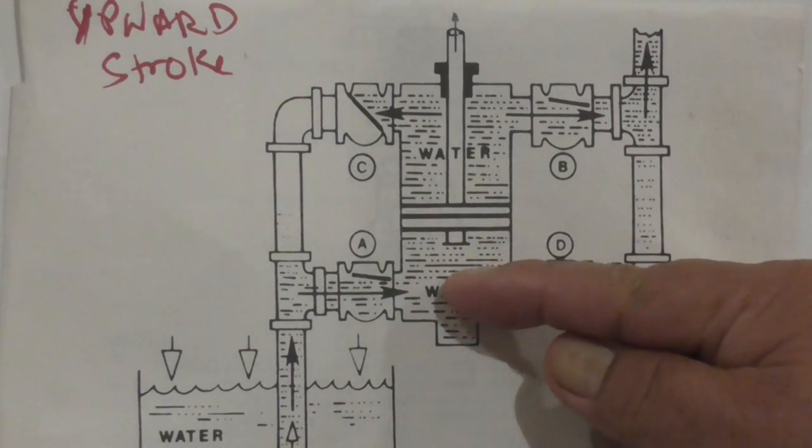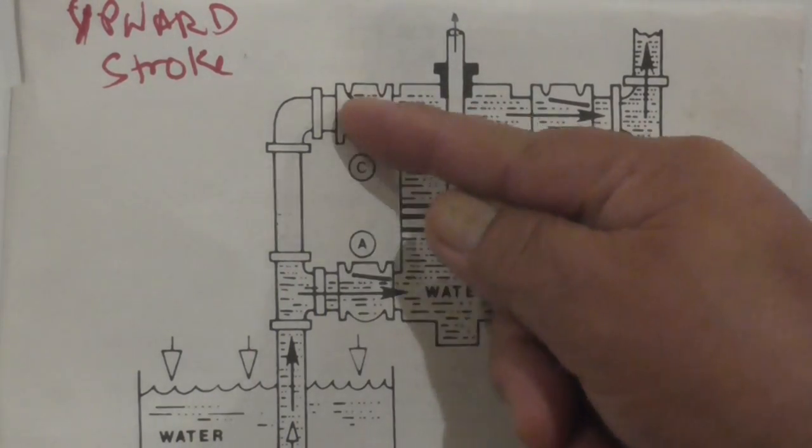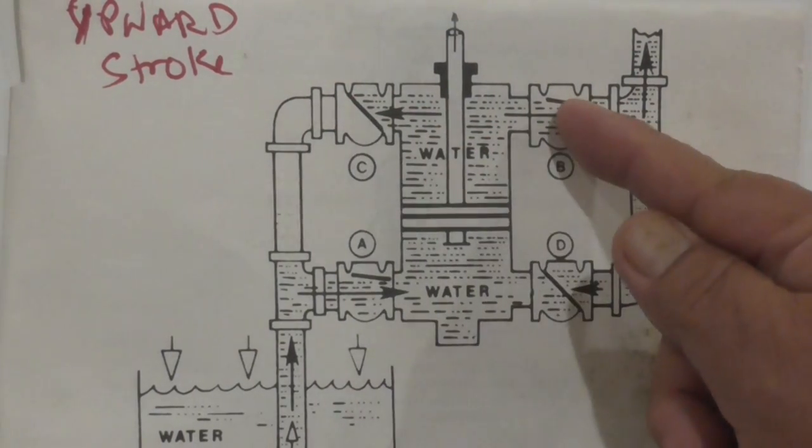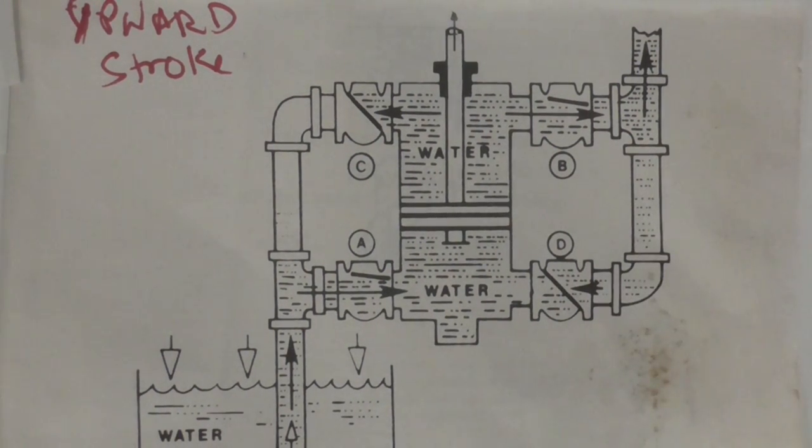Once this is discharged and the piston is ready to go up, this valve will go in this position, this one is closed and that one is open, discharging the fluid. So the process will just keep repeating itself because it's in a cycle. If you want to fill up a tank, or even at all times with no interruption, just let it run till your project is completed, to transfer a fluid from one container to another container. But the process will just be continuous, just like what I have discussed.